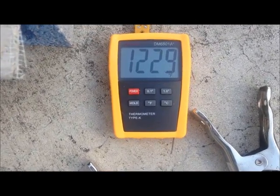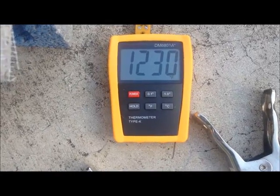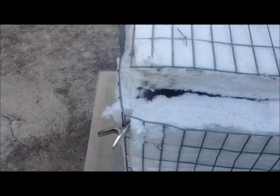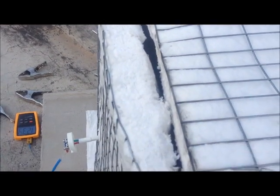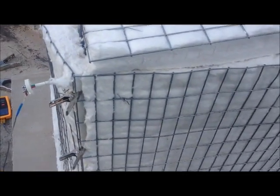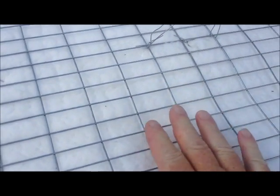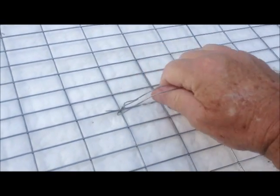It's been 4 hours and 34 minutes since we started. We're at 1,229, almost bumping on 1,230 degrees. No change in my flue setting — I've pretty much left it adjusted just like this. I have kicked the burner up a notch. You can see we've got the blue flame going in there now. I backed it off about an inch to an inch and a half from the entrance. All the heat's going in — you can see no flames are coming up. We've got the oxidation-reduction thing going on right, I think. It is warm to the touch on the outside but it won't burn your hand unless you hold it there.